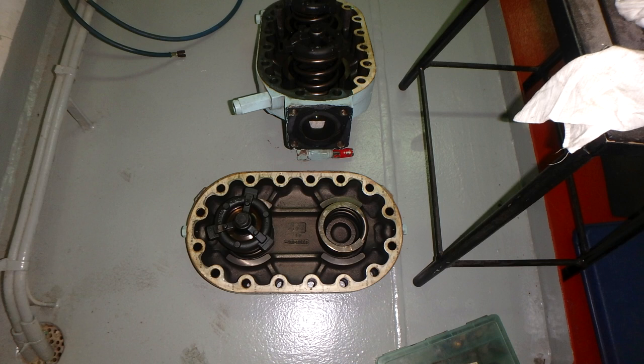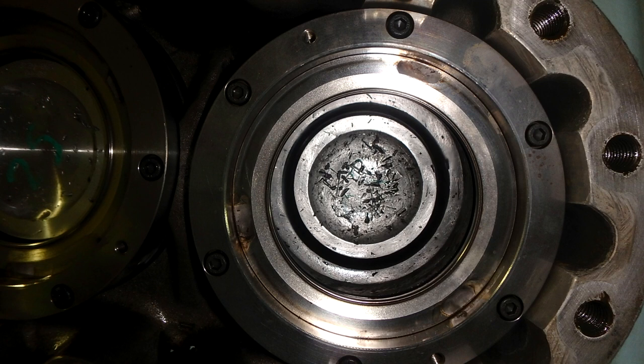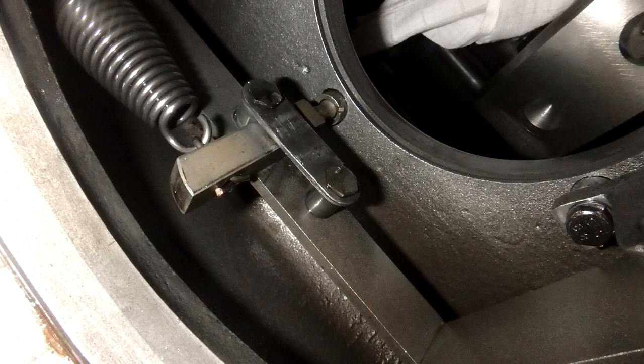What was the cause of that damage? A nut and bolt had been put in the place of the rivet that the manufacturer had used, which I believe is stronger against vibration than a normal nut and bolt, which would be loosened by the vibration that the machinery has. That's why the manufacturer uses the rivet in those places. As you can see, the damage is several. We only saw that on the top of the piston. The liners were okay. All the valves that we checked were okay, with no damage on the valve surfaces.